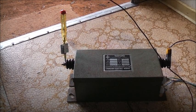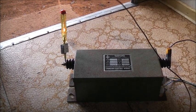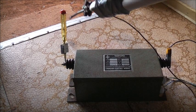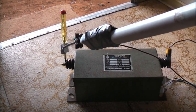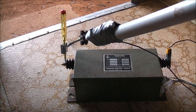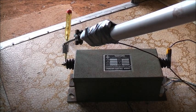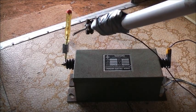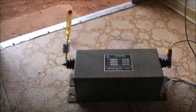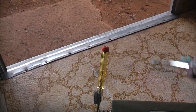There you go. Well then, let's put your life on the line with some $2 Taiwanese or Chinese-made screwdriver — that thing's going to save your life. Corona on that label. That's 10kV going through there — that's the breakdown voltage. So the resistor's already bloody gone up in smoke. It couldn't resist. That's already buggered. So that will allow the full 250 volts to your body now.